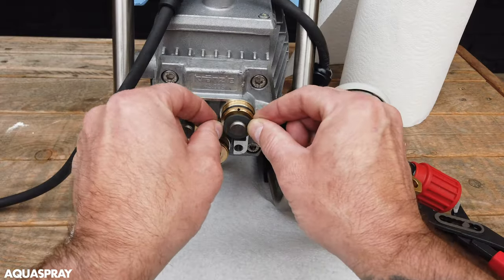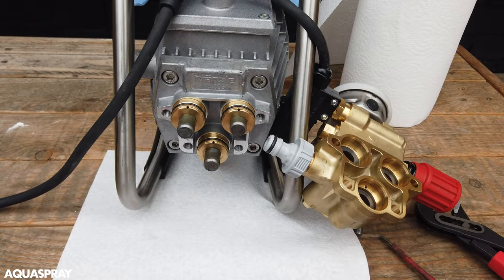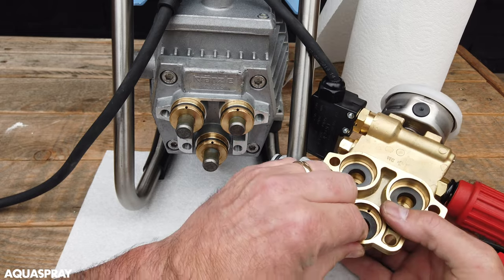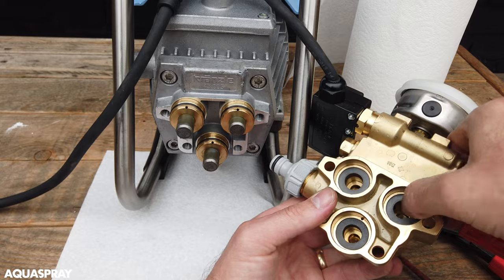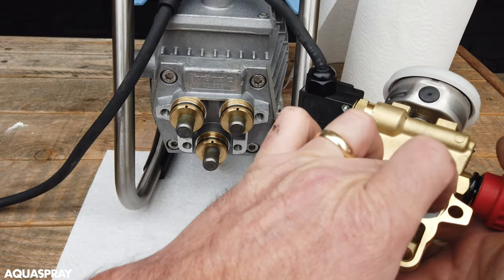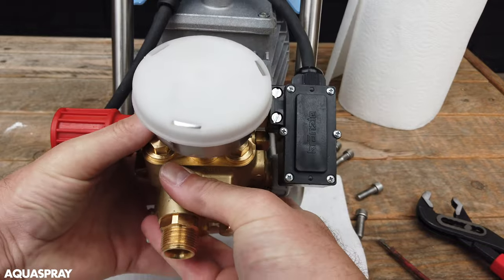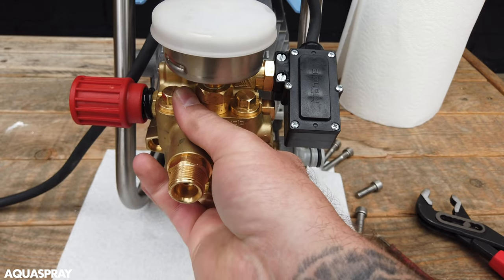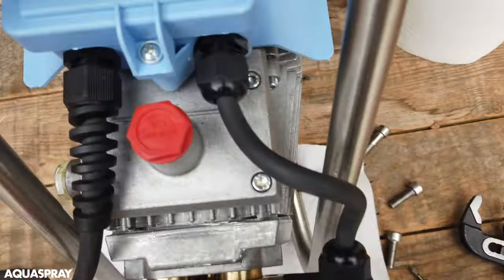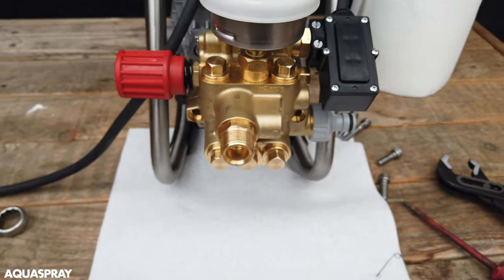Once the seals are in, it's only the washers left. Some people put the plastic washers in first, but you can't see whether they'll get trapped in the pump head that way. I've always put them into the seals first so they sit flush. Once they are perfectly in there they shouldn't fall out, but if they do you can put a little smidgen of grease to hold them in place. When putting the pump on, keep it as even as possible, then slowly rock it backwards and forwards until it's over the pistons and brass collars evenly — only then can you start to put the screws back in.